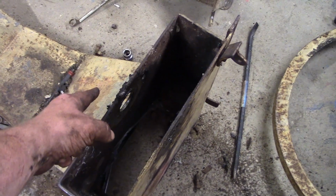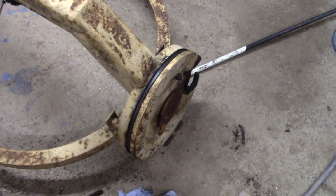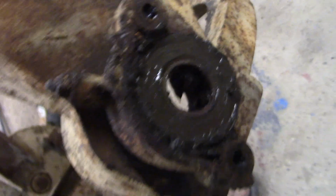This is one of 4 bearings in the engine side of things. One on the outside, double one on the inside, and then one to carry the yoke on this side. Another one at that end in there still. Yeah, it all looks pretty straightforward. The bit of bearing damage that I was worried about hasn't really touched the bearing. It's just that this is a fabricated piece. The bearing sits in this flat piece here. I need to strip this all down still, but it's just the cover to keep the grease in that's come off.